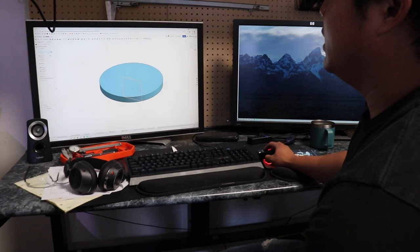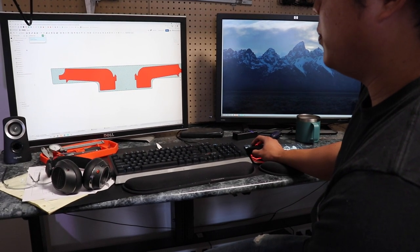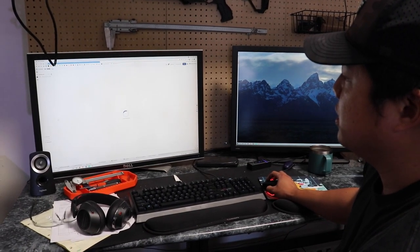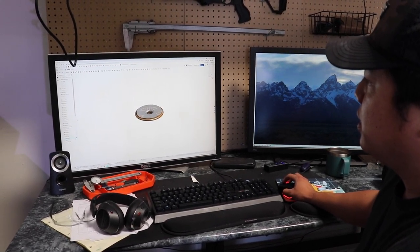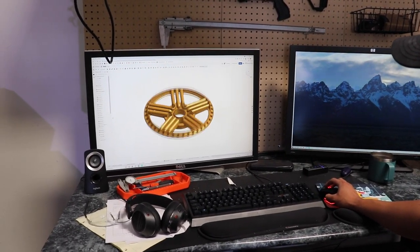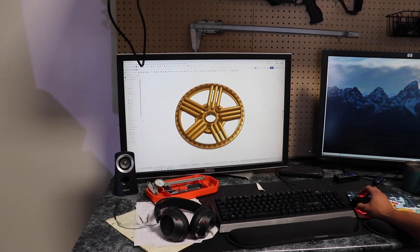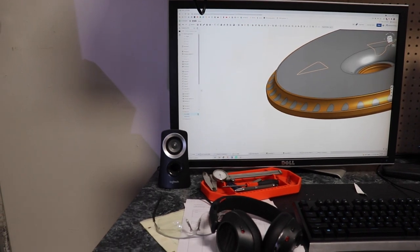I can get a design program up and walk through it a little bit. So this is your wheel right here. We have the forging, then we designed the profile and took it to the lathe to get turned. Now we're gonna go from this lathe profile and mill out everything. For you guys at home, that's my wheels right there — that's the wheels we designed. It's basically the right shape but it just doesn't have any of the windows cut out or anything like that yet.